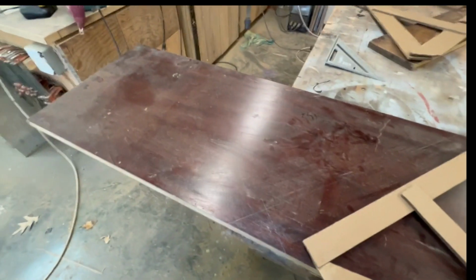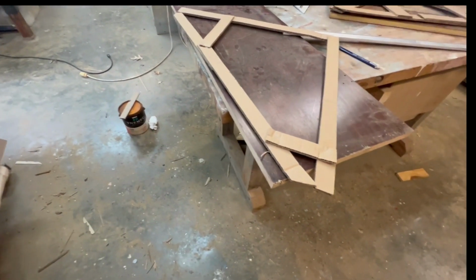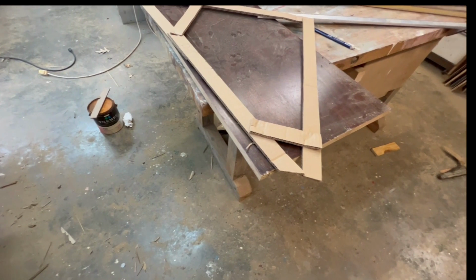And probably have to move them in my wife's studio because it's cold. It's getting cold tonight, and I think 50 degrees is the limit for the yellow glue I have, and it's supposed to get in the 30s. So we'll clamp them, and I'll drag them next door.